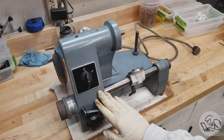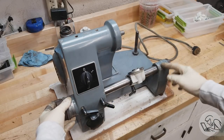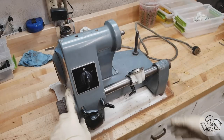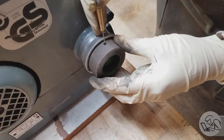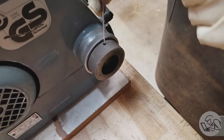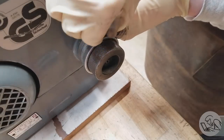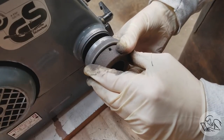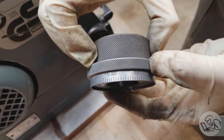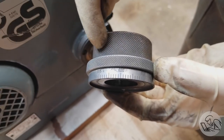To dismantle the body of the machine, we've got to start by taking this bar out. This is like the ways of the machine, and there's a spring-loaded cap at one end that preloads the whole assembly, and then there's a micrometer adjustment at the other end. The only fastener on the whole thing is this little set screw on the micrometer knob. So we'll start by fishing that out, and then the knob slides off nicely. You can see how nice the markings are — these must have been photo etched.